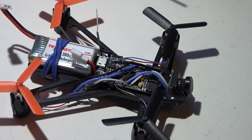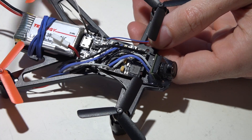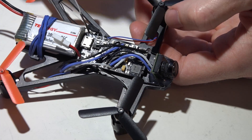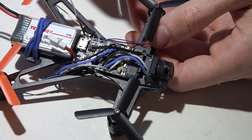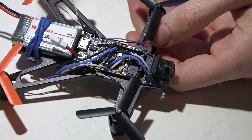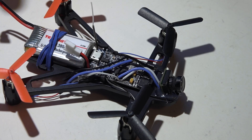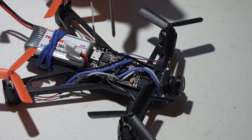I'll also leave all the parts used in the description below. This all-in-one flight controller has a built-in on-screen display that is also capable of being used with Betaflight's OSD feature, meaning you get that really nice OSD menu where you can change your PIDs, rates, expos, filters, and much more. They also have three different versions depending on what transmitter you're using: a FrSky version, a Spektrum version, and a FlySky version — which can also be used with Turnigy transmitters since they use the same protocol.